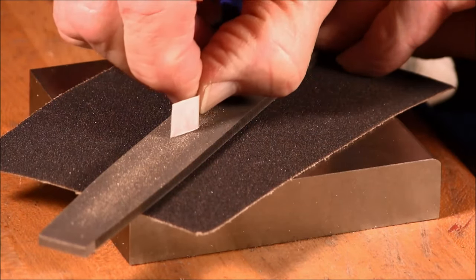The last secret is even heat — we'll heat both pieces of metal evenly. I'm going to put a little extra heat on the bottom one. And there it goes. Then I'll run it along the seam, and there we have the solder running along the entire seam of the sheet silver. We only used two small pallions at either end and were able to draw the solder in along the seam. Remember, you don't need an awful lot of solder — just a little bit and you can draw it right along the edge.